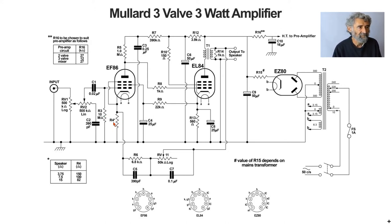There is no bypass capacitor on the cathode resistor because negative feedback is applied there. The EF86 is pentode-connected but unusually: the screen grid is fed from the cathode of the output valve. That resistor looks rather high for an EL84, so there are more volts on the cathode than normally expected. There is massive decoupling with a 25 microfarad capacitor for the screen grid, giving very clean DC to the anode of the EF86.